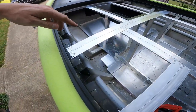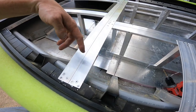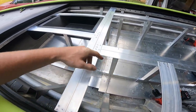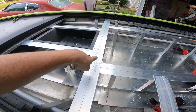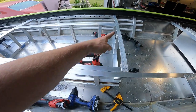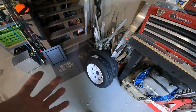Looking at all this now, I probably should have run the pieces going this way underneath this side bracket, mainly because now when I put my lid on top, the long side of the lid is going to be a sixteenth of an inch off. If I had put these underneath and then ran these pieces on top, my short side would have been a sixteenth off. So now I'm going to have to fill the gap on the long side instead of the short side. I have enough scrap pieces of one-sixteenth material here.